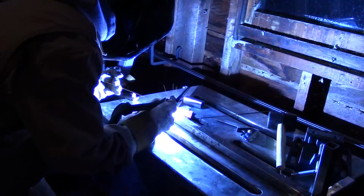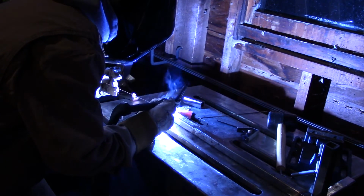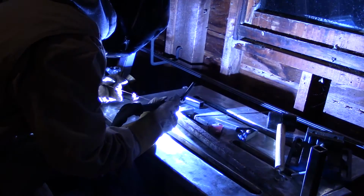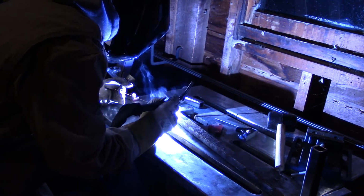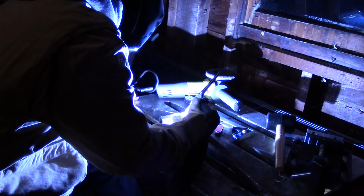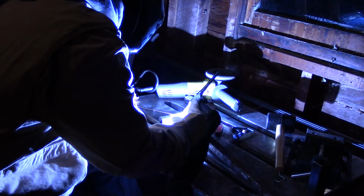So now that the base has been welded up, the next thing to do is to weld on the area that's going to support the piece of wood. I'm actually going to weld end caps on in the next video, the next part of this series, and on those end caps are going to be welded 2 to 4 little brackets to support the piece of wood and hold it in place and keep it from moving anywhere. So I'm just putting together the little 3-inch section on top. It's being put together exactly the same way as the 12-inch section, the base. It's just on a much smaller scale.